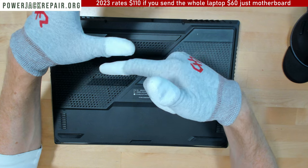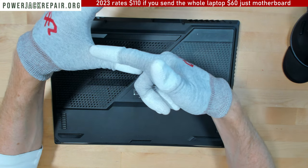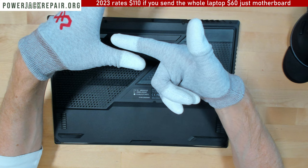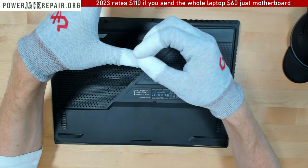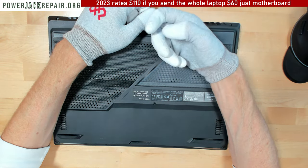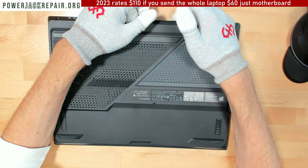And when there is not enough metal-on-metal contact when you plug the plug into the jack, it's kind of like contacting like that, for example, or like that, or like that. This area heats up a lot, produces a spark. The inside of the plug gets oxidized. If you look inside of the plug, almost always, it gets oxidized.